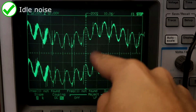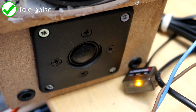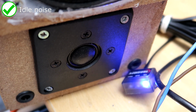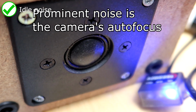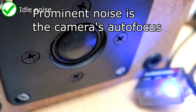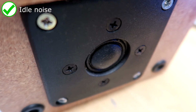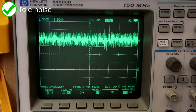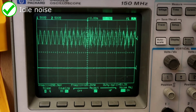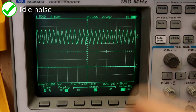Since this amplifier has both sides perfectly matched, it produces little to no audible noise whatsoever when powered up, even through a connected tweeter, which is very sensitive. This is a problem with Class D half bridge amps, since any noise created by the output section is referenced to ground, which is naturally dead flat, allowing for the connected speaker to see a potential difference across it.